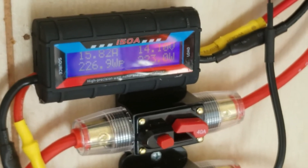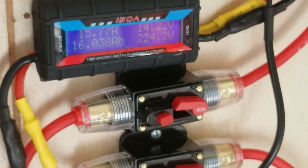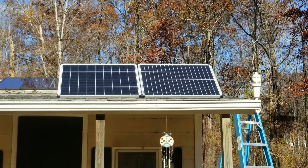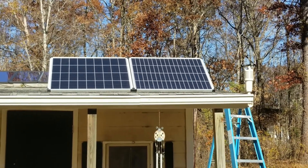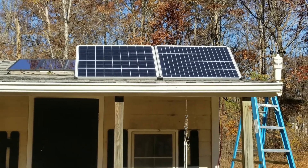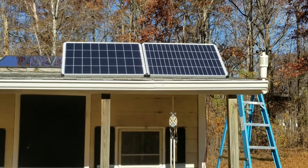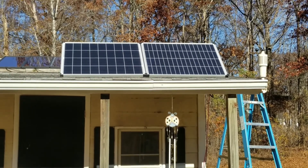With a little bit of angling and a little bit of cleaning, you can definitely achieve more wattage from your panels — we're getting about 50 more watts. With the change of every season, if you can angle your solar panels and wipe them down, it's a definite help — over 50 watts more into the batteries. More wattage and more amperage means faster charging. I hope this helps, thanks for watching, please subscribe.